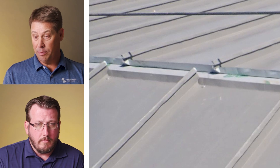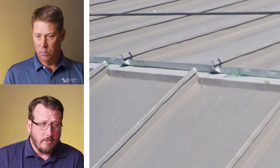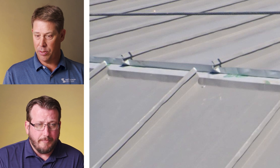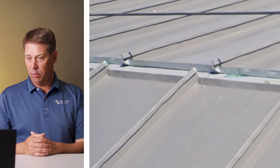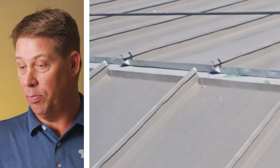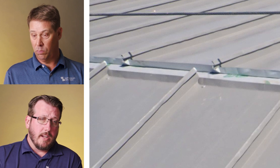It's a ridge — we've got panels boxed, that's a good thing. They're pinned down, seamed all the way up before the ridge cap gets put on. That's always an indication of somebody that cares. Seams are a little wavy, but that happens. They might have hand-seamed that top portion to get the Z's on and finish out before they got the machine. From a weather-tight standpoint, that all looks good.